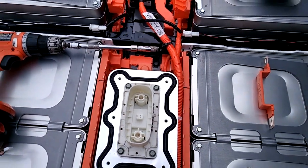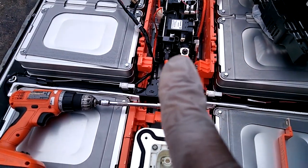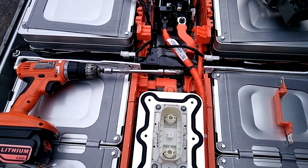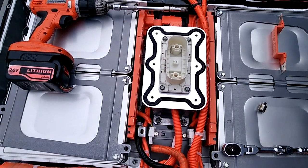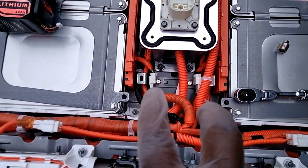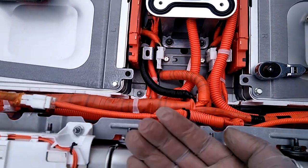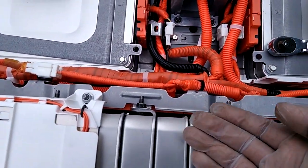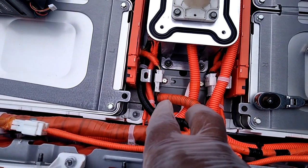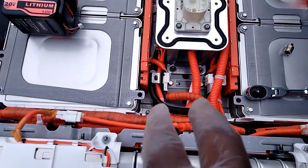The most appropriate place would have been those two points over there, but I'm looking at the cable. The point of entry to this casing should be at the highest point of the casing, which is right at the top here. So the middle up here should be the best place to get entrance into the casing.